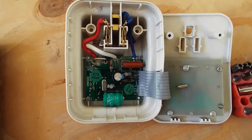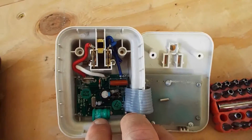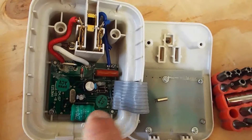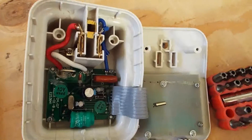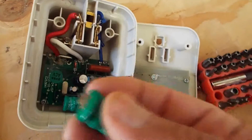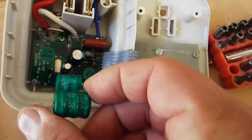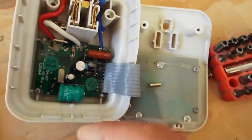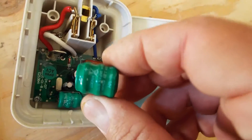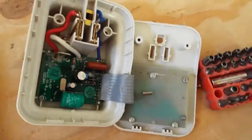So I got it apart, and I'm checking the circuit out. There's a little battery backup in the circuit that should be a 3.6 volt battery, but when I measure it I get about 1.6 volts across it. So there's a shorted or damaged cell in this battery pack. I luckily happen to have a different battery pack to replace it with - it's twice the size and twice the capacity. The one originally in here is a 40 milliamp hour, and I have an 80 milliamp hour to replace it with.